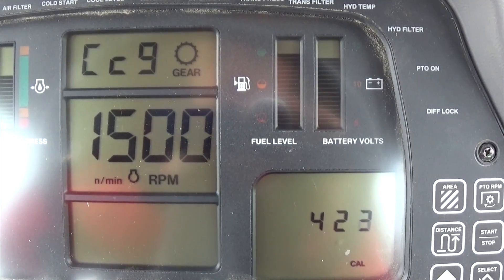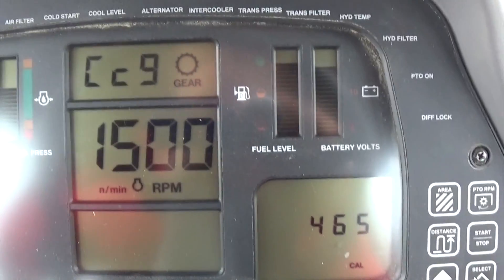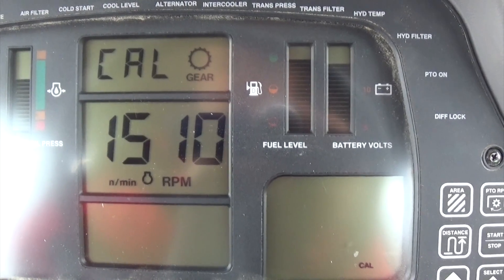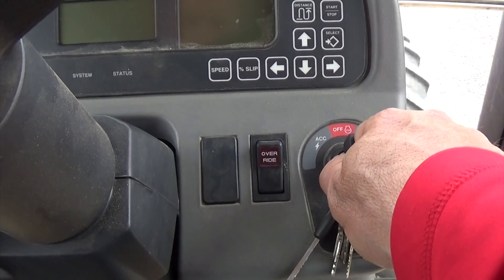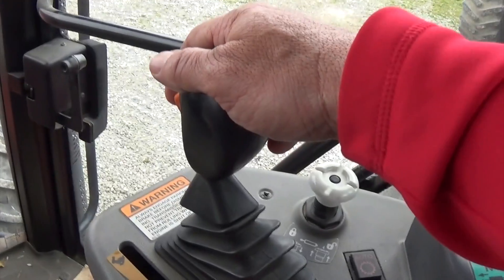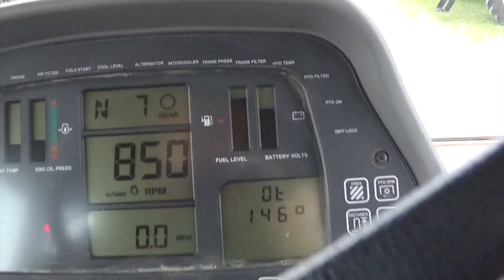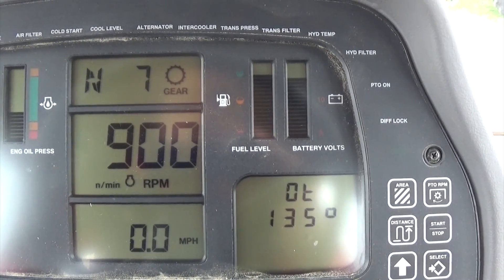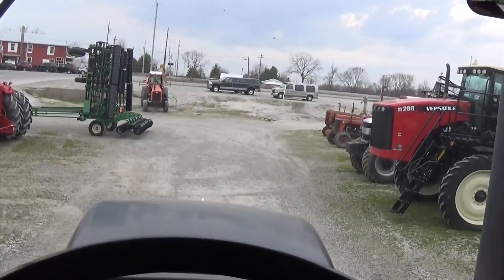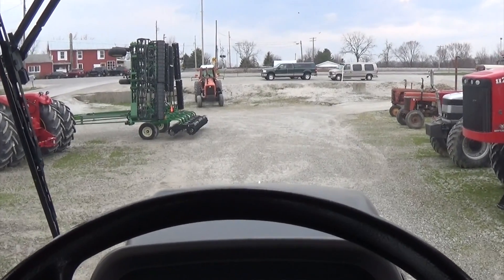Here we are on the last clutch — the ninth clutch — which is actually the reverse clutch. When this clutch finishes, the tractor is actually going to back up a little bit. Once the calibration is complete the tractor shakes a little bit too. Right there the calibration is complete. Now you just pull your throttle back to idle and shut the tractor off for five seconds — that saves the calibration. You have to shut the tractor off because once you start calibration mode, the tractor will not move until the key is shut off and restarted. Turn the key off, restart the tractor, and it'll move fine after that. Pretty simple process — this is a common question I get asked, so I thought I'd make a quick video. Thanks for watching, I hope this helped.